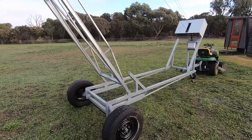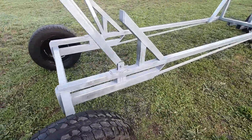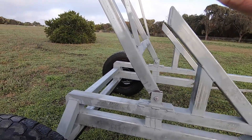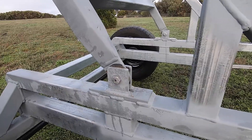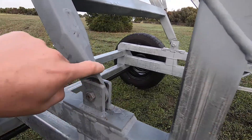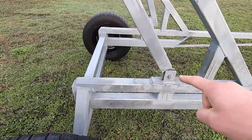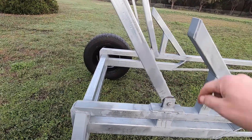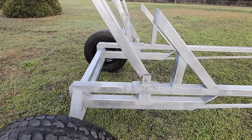This crane is a counterweight crane that uses a vehicle as counterweight. The fulcrum is a solid axle at the front of the frame. Right behind the axle is a structure that needs to be really strong to support the weight of the boom — these two points are going to take all the weight of the boom and anything on the hook. I've made up these hinges from 10mm plate steel to distribute the load across the frame, and the hinge lugs are welded up inside the RHS for extra strength. The hinges are positioned behind the fulcrum so that the boom's weight pushes down on that side of the fulcrum, offsetting the weight on the hook side.